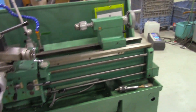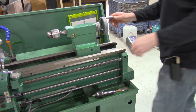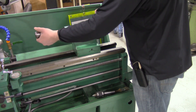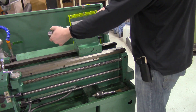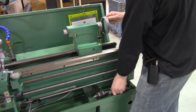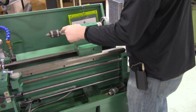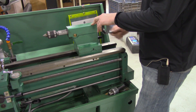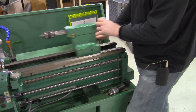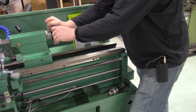Toward the end of the lathe, we have another feature called the tail stock. The tail stock can move in and out — a lot of times we use it for drilling operations, installing a drill on this end. It has a taper lock so it stays engaged; to remove it, you back up the tail stock all the way until it hits a stop. When installing tools, give them a good snap and the taper locks them in place. There's a small lever to lock the tail stock spindle and a large lever that allows the whole tail stock to move forward and backward along the bed. When it's locked hard, it shouldn't be going anywhere.